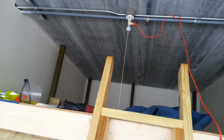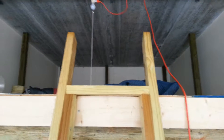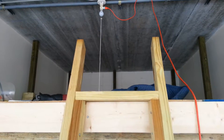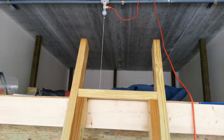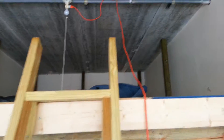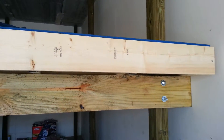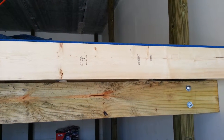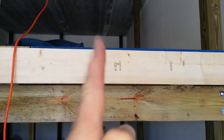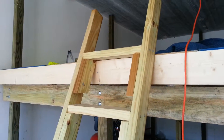I don't know that I'm going to diagonally brace it the other way. I think maybe I'll leave it on the front — I'll have this bottom one. I really don't foresee that bottom moving that much. That thing couldn't collapse. It's not going to fall backwards because the wall is there, and it's going to have a really difficult problem falling forwards. This whole floor is attached as one unit, so I'm just going to cross brace these and leave it at that.